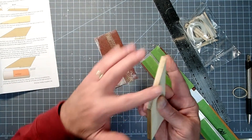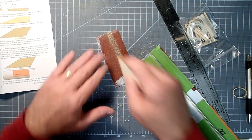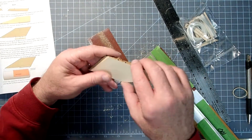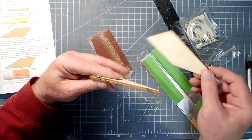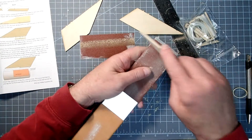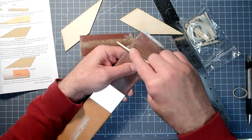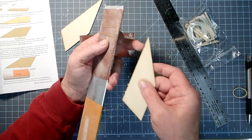It's fairly smooth, but I can still see pronounced grain there. So after I do some shaping, I'm going to come back with 220 grit. The only streamlining we need to do is to round the leading edges — the tip edge and the trailing edge can just be sanded square. You can lay down a piece of sandpaper and do all those edges at once by dragging across. You want to do this just until you don't see the charring from the laser cuts. Don't sand off these little projections — those are going to be necessary to fit some of the trim pieces on later.